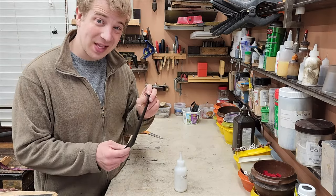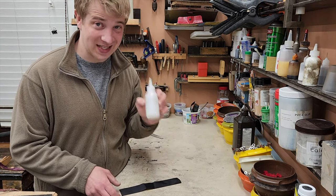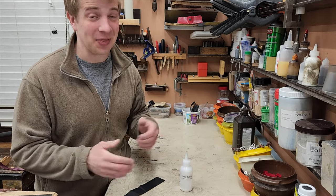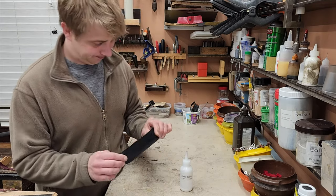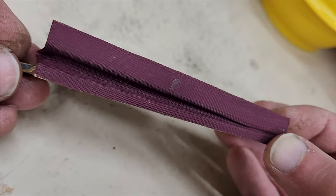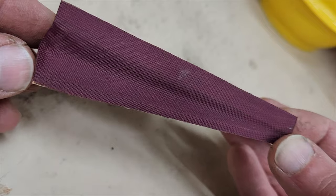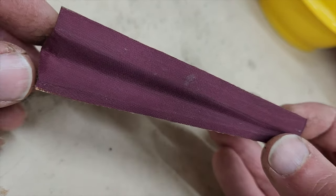Now, the thing about using synthetic cloth like this is that you can only use synthetic glue to stick it down. Not sponsored. Of course, this is a very controversial topic in the restoration community, and for me, that's part of the appeal. Here's a pneumatic that's got some synthetic cloth on it, and therefore the synthetic glue. It's had about 10 years to dry, so I just want to show you that you can peel the old cloth off and actually remove the synthetic glue.